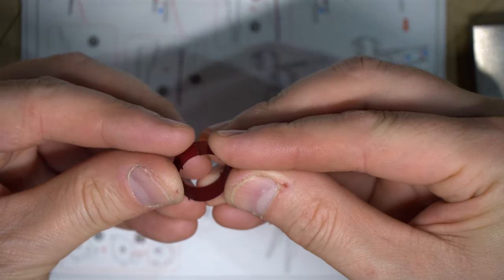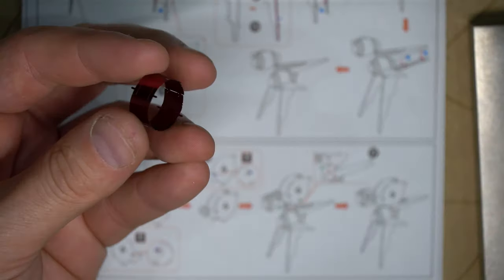Let me make sure I'm doing this right — this textured portion needs to be on the inside and this portion with the lines or artwork needs to be on the outside. 700 turned out to be maybe a little bit thick, so I'm grabbing 650. These tabs should probably exist on the inside, so I'm going to take these tabs and bend them inward. Anytime you have two tabs that need to be bent, always use whatever tool it takes to do them both at the same time — then you know they'll be in perfect alignment to the slots.